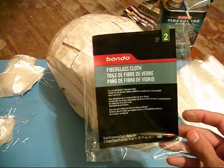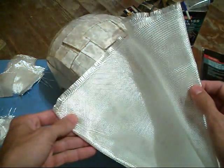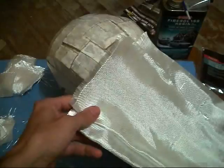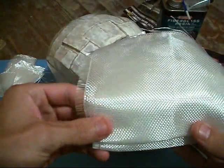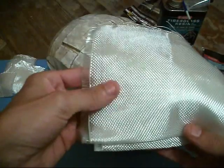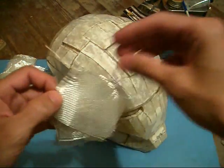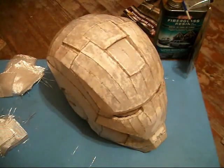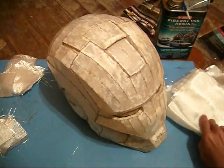This is how it comes, just in a little bag like this — about eight square feet in this little bag. It's just a woven cloth. There are two different types of fiberglass you can get: fiberglass cloth and fiberglass mat. The difference is that the cloth is woven together in a square pattern at 90 degrees to each other, whereas the fiberglass matting is basically just little strands scattered all different ways made into a mat. They're both just as strong — it just depends on what you'd like to use. I think the mat's a little bit harder to work with than the cloth, so that's what I'll be using.